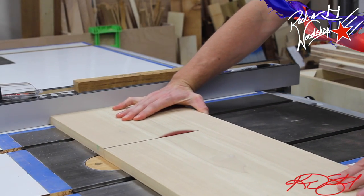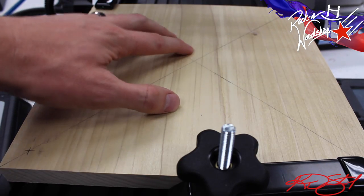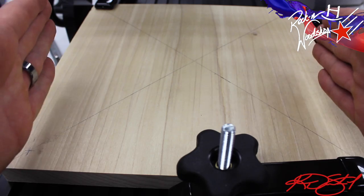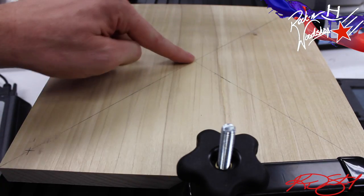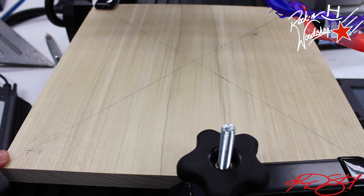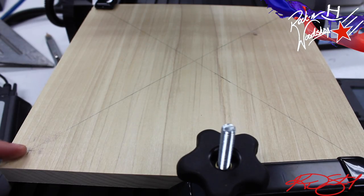I'm going to cut my piece of wood that I'm going to put the carving on. Here's my 11 and 3/8 inch square piece. My original measurement for the carving is 10 by 10. I've made an X from corner to corner, taken the 1 and 3/8 inch measurement and halved it, measured from each side, and made a crosshair extending through the X line. That'll be my starting point for the machine — you can also use the center to simplify things.